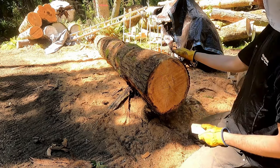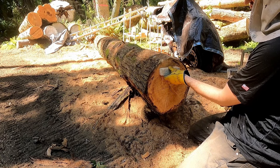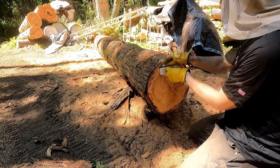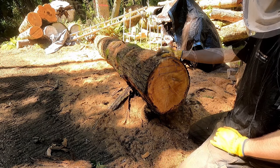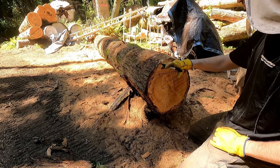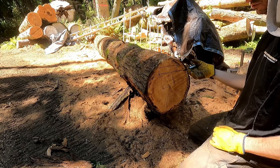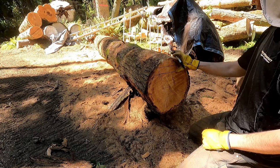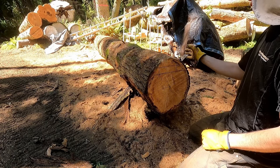I notice on this log that it actually hourglasses in a little bit — there are knots right by the end, so it's actually thinner there than further in. So I'm going to be pretty generous with my placement and trace it. I like to do the second cut first: I'll cut on the bottom rather than the top, because screwing into the bark doesn't hold and you can't put a screw near the cut line without risking hitting it with your chainsaw and dulling the chain. So I set my mill to cut deeper and do the bottom cut first. Then I'll flip that piece over, put the ladder straight on the flat surface I just made, and do the second cut. That works really well.